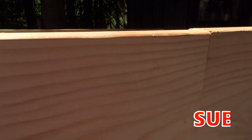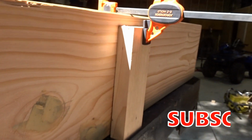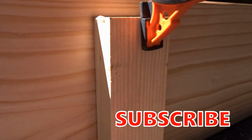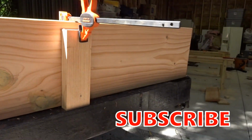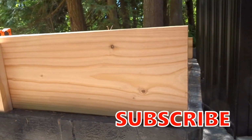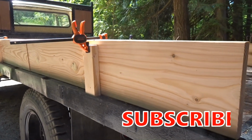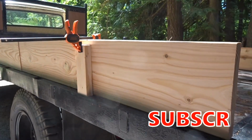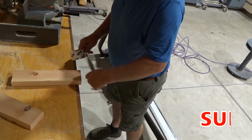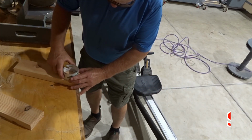I'm going to put a round over on the top here, and on the sides here, and then we'll bolt them up with some carriage bolts. So that's the project for today. And then I'll probably try to finish it with some sort of wood sealer to keep it clear, and I think that fir will look pretty nice actually. That's pretty decent stuff.